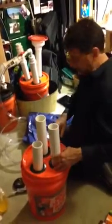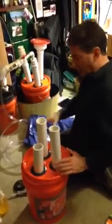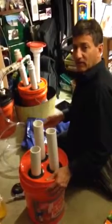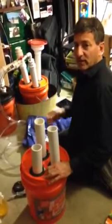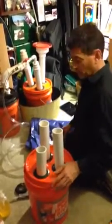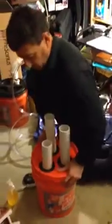And then you should get about, well, this is a 5-gallon jug. You might get 2 gallons of gas, maybe up to 3-4 gallons a day from this, which you can then use to do nice demonstrations or collect in a bag until you've got enough to cook with or make tea with. But please do try this at home. It's really simple. It's a quite effective way to get in the game.